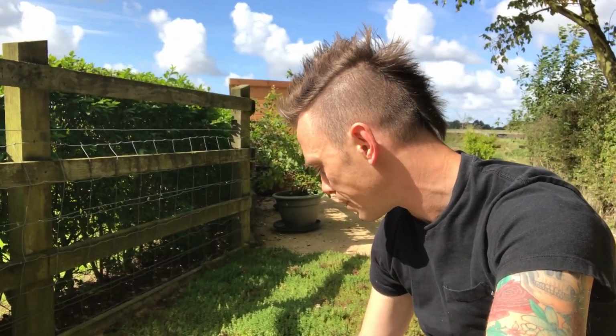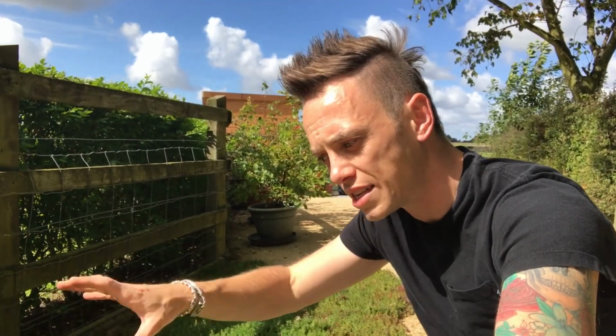So now that I've got the substrate up on the roof and the sun is out, I'm going to re-roll one of these blankets of sedum, simply for ease of getting up the ladder and on top. And you want to try and keep your pieces in as large a section as possible when putting them out. Like turf, you don't want lots of bits stuck together because the edges dry out and it's difficult to take. So keep them as big as possible, but only insofar as you can lift them up, or get a friend. So I'm going to roll this and pop it on top now.